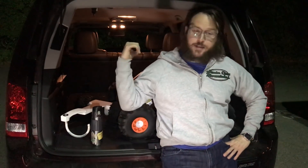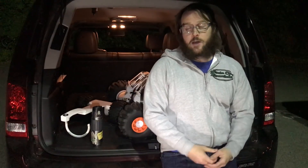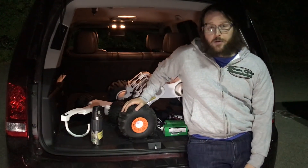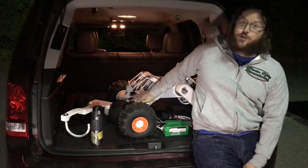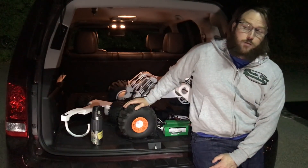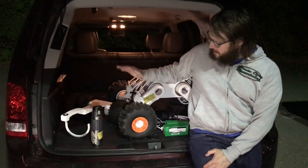What's up YouTube, it's Taylor. I've got some more videos with Rover — finally got Rover V2 fully functional with the new gearboxes. Rover V2 the first time I built it had the same gear ratio as Rover V1, a 4.3 to 1 gear reduction, but the tires on Rover V2 are twice the diameter, so the same gear ratio wasn't enough. I moved to a two-stage 11 to 1 gear reduction, which is finally up and running, and I've got some video clips of Rover driving around some stairs.